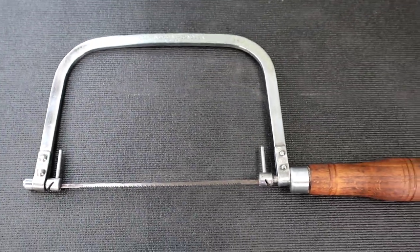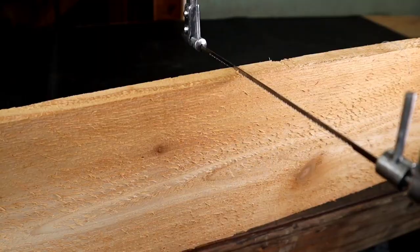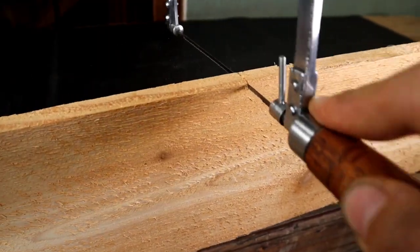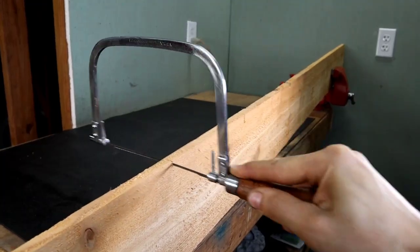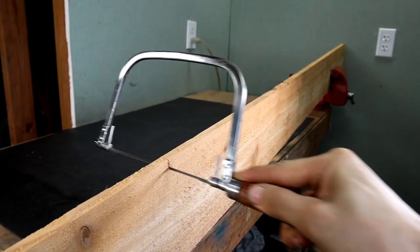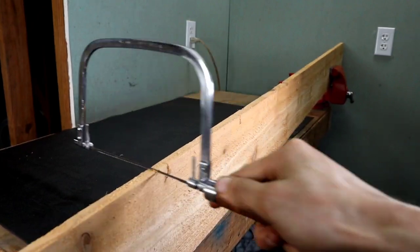After a final look at how the piece turned out, it's time to put it to use. The coping saw is great for making curves in your cuts — the finer the blade, the tighter the turn that you can make. The last question you have to think about is if you want a push or a pull cut. The push cut cuts the wood as you push the blade forward, and the pull cut does the opposite — it cuts the wood when you pull the blade towards you. Comment below with your personal preference.